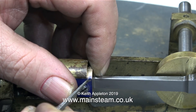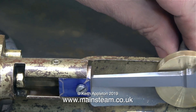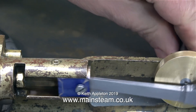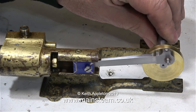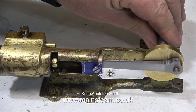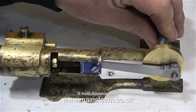The other end of the crosshead can't go fully up to the cylinder because the crosshead nut is in the way, but it won't be when I make the crosshead into its final shape. The main thing is everything is in good alignment — as I say frequently, it's not too tight and it's not too slack, and that's not a girlfriend joke. In the next episode I'll finish the crosshead, put the piston in place, check all the travels, then the engine will be ready for painting, followed by reassembly and running.